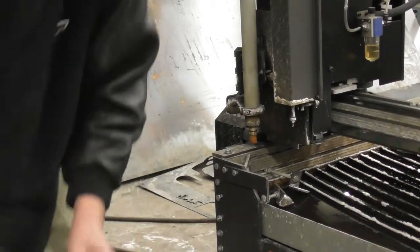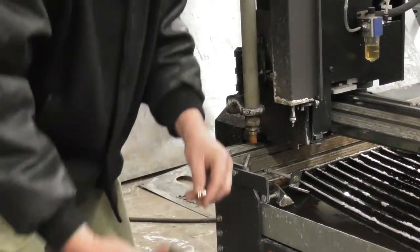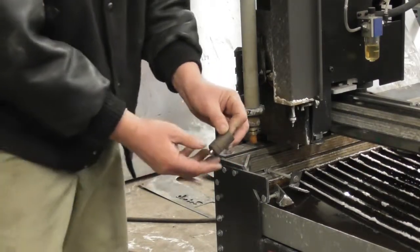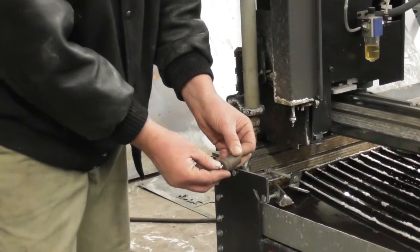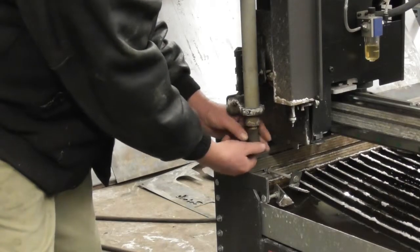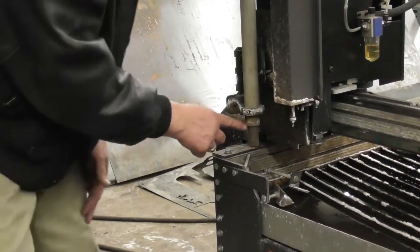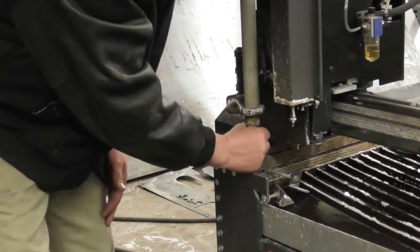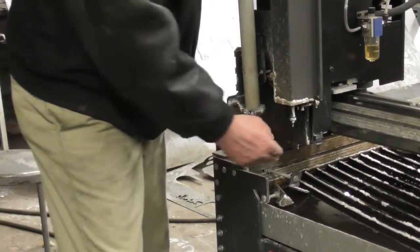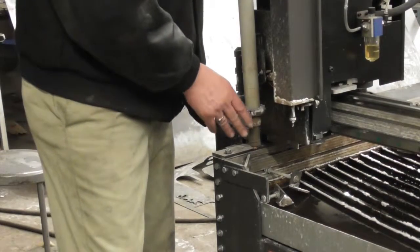I'm going to put in a new set of consumables. You can see the difference in condition. You need to match the consumables with the machine — they're not very expensive. I bought these on Amazon; it cost me $114 for 20 of them, about $6 a piece. The metal you're cutting is a lot more expensive than the $6 you're going to pay for a new set of consumables. Insert it, tighten it up — make sure it's tight but don't over-tighten it or you won't be able to get it off next time. Make sure the lower ring and the upper ring are tight, and make sure the head is straight up and down. It's on a removable magnetic connection so that if it hits an edge, it breaks loose rather than bending something.